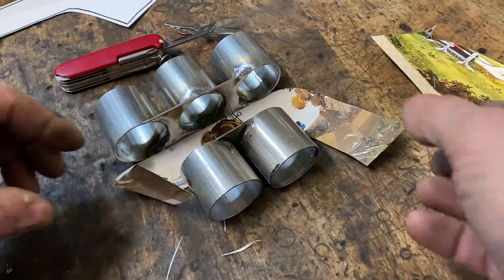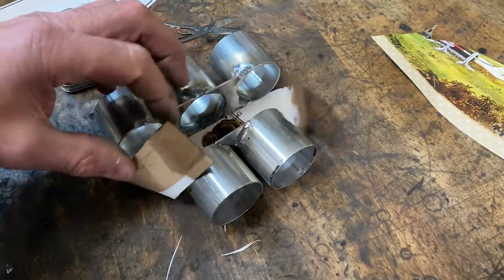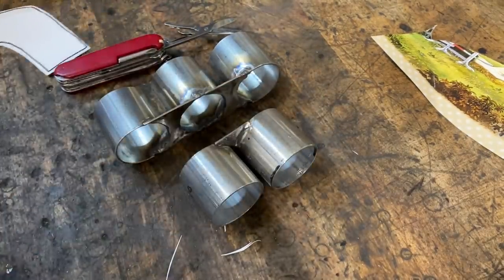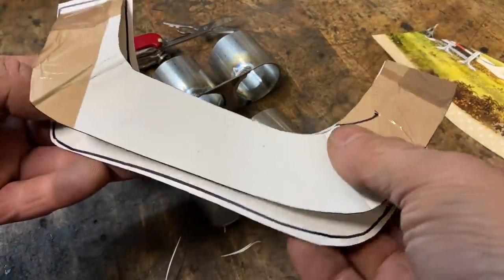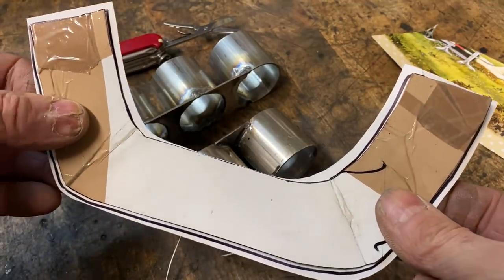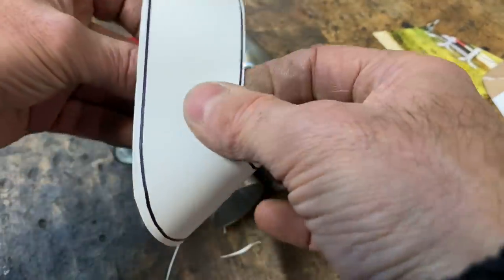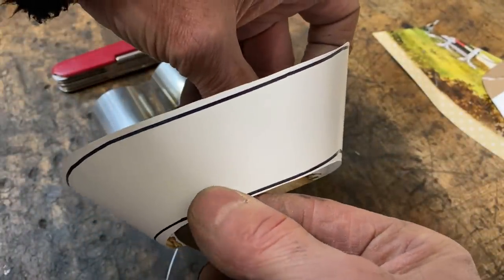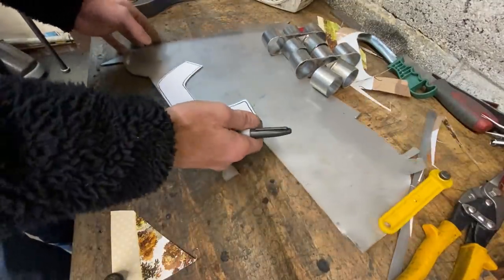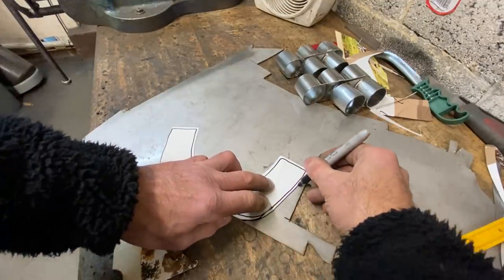With the parts all cleaned up, it's time to make the centre section. I get a piece of cardboard, roll it round and cut it out with my pen knife to the right size to make a template. I drew round the original template onto a fresh piece of card making it very slightly bigger, because it's best to make it big and then trim it back to size afterwards with your angle grinder once it's bent to shape. The next thing I do is draw around the template onto some 1.6mm thick stainless steel and use my marker pen to mark out the profile.